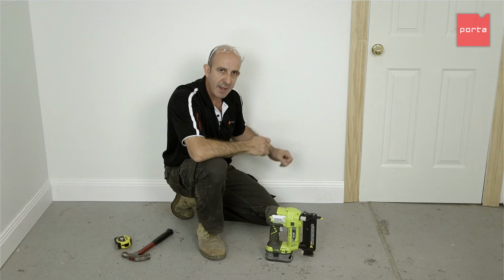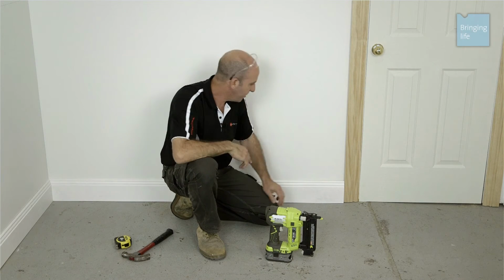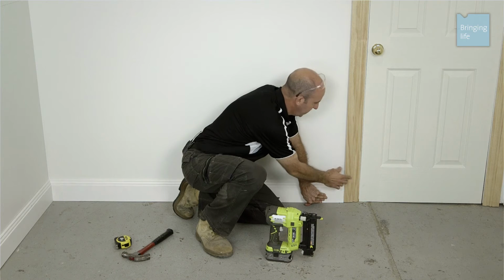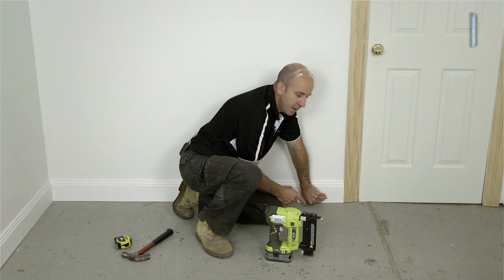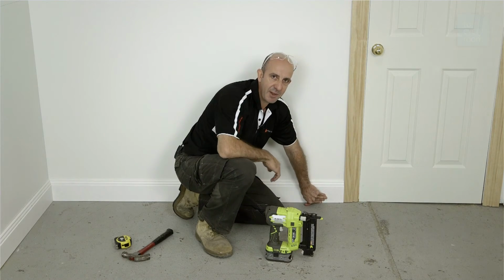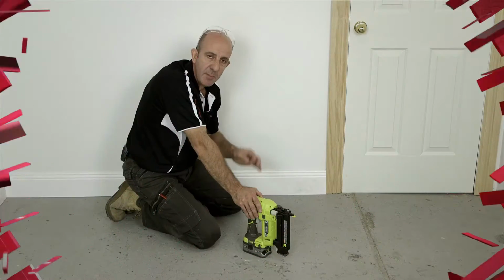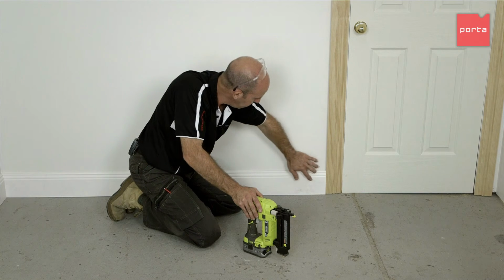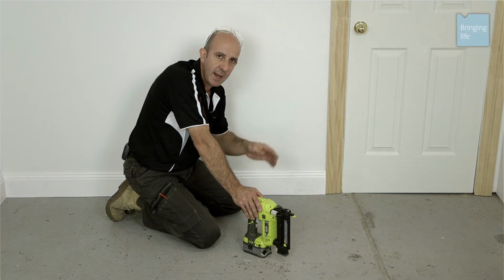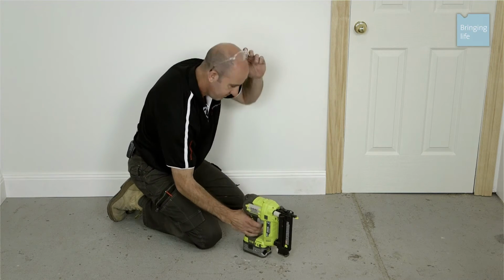Make sure you put the nails behind the line. One tip also, on the end here, chances are you're not going to pick up a stud there because the architrave will be covering it. So you can just skew a nail in at an angle straight into the architrave. Be a bit careful where you choose to nail your skirting. Just use this flat section here because that'll make it so much easier later when you fill it and sand it.